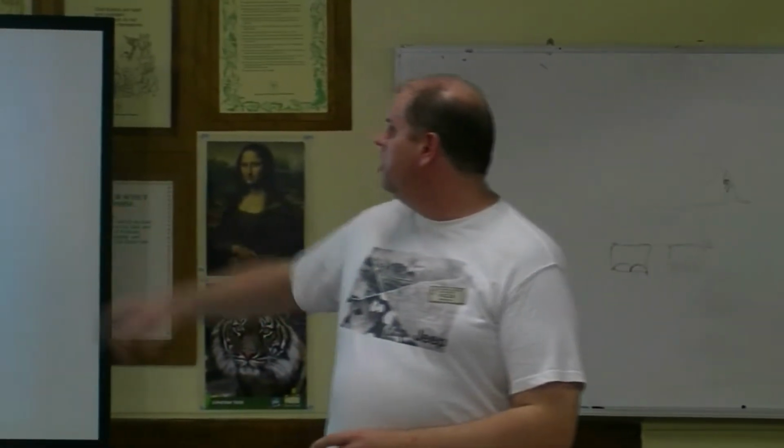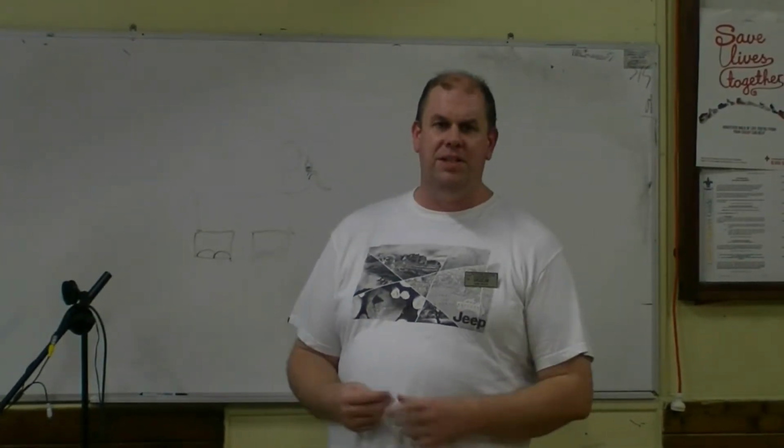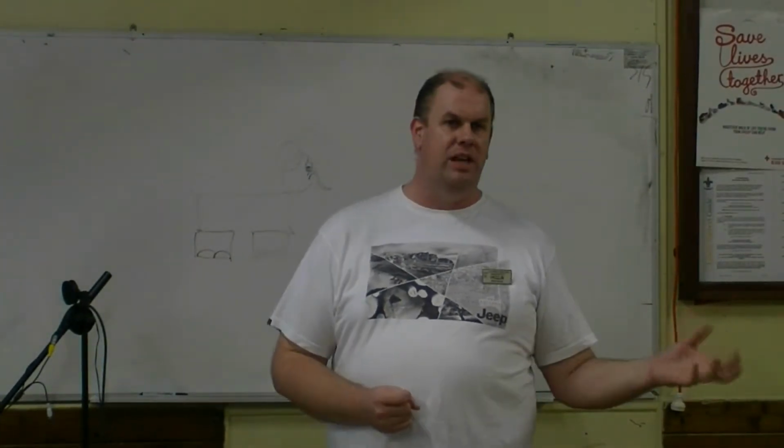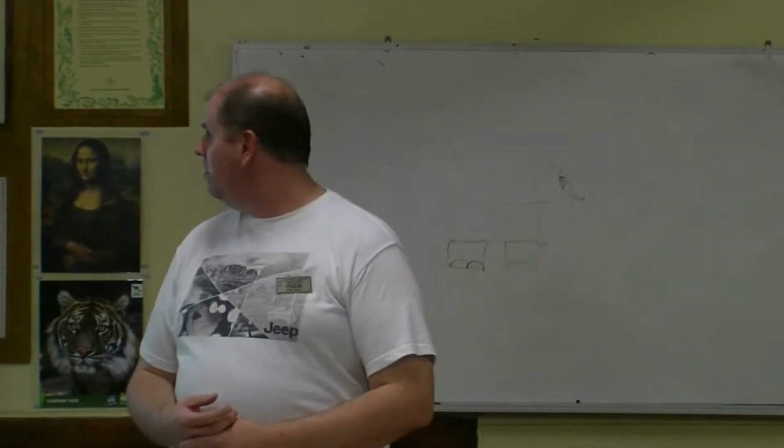However, one thing to note, all DMR users must register for a DMR ID. The IDs, they're not particularly complex, but everyone's got to have a unique ID worldwide. And you have to go onto the DMR MARC network to register that ID.